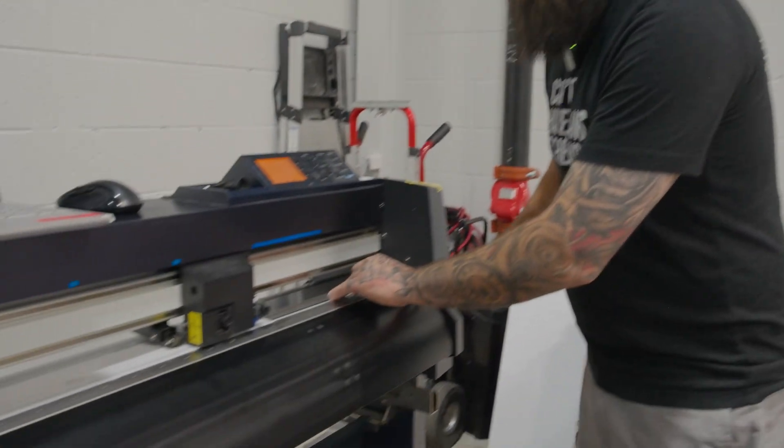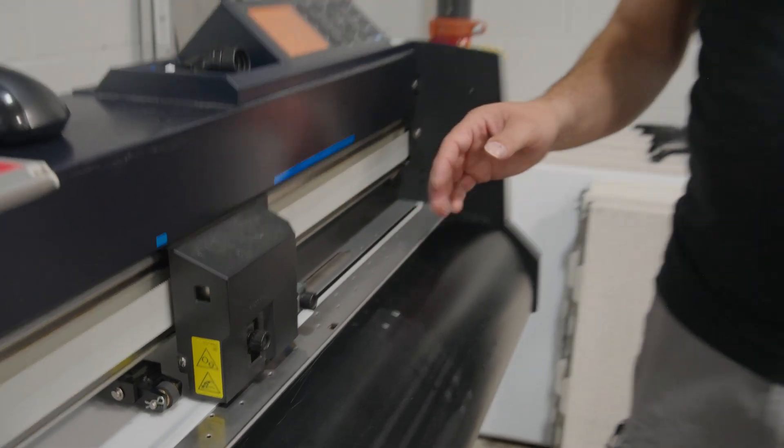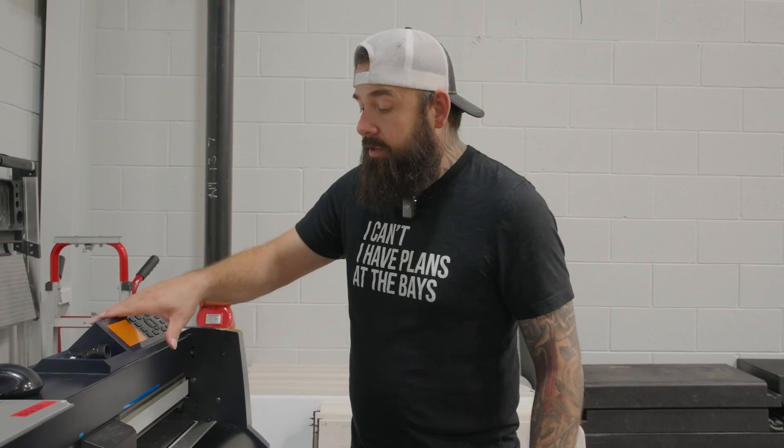Very important though: if you cut this teflon strip here on the bottom of the plotter, it has to be perfectly smooth. If you do a test that actually ends up going all the way through the film and scores this teflon strip, you will need to replace it. Imagine a big piece of film on this plotter — the blade is set perfectly — and then it comes to a gouge or a divot. That is going to change the way the plotter cuts that film in that particular section. So it's very, very important that you do test cuts and make sure your force is perfectly in the right place when you're changing films or cutting any film.